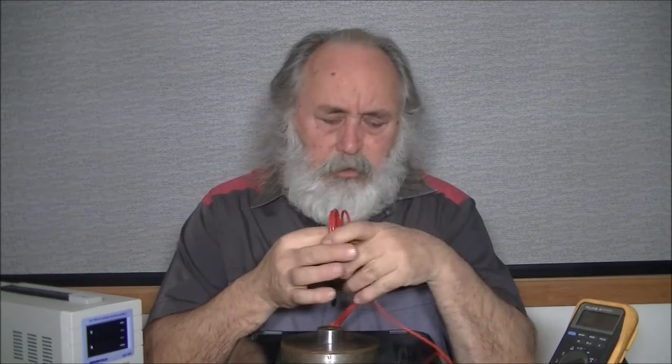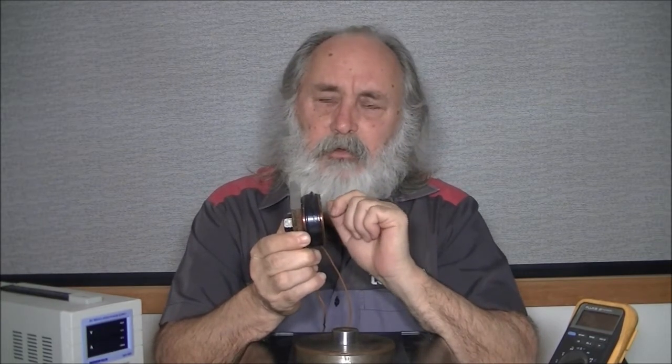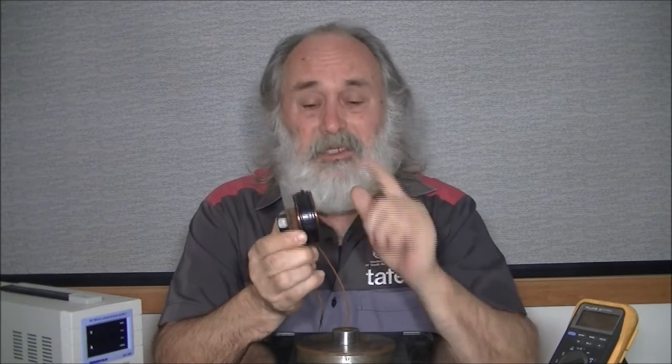The third thing we can do is add a soft metal core to the inside of our windings. Here we've got a very simple coil of wire with a soft iron core. When there's no current passing through it, very obviously there's no magnetic field. But as soon as we turn our power supply on and pass current through it, we can see it becomes a really strong magnetic field — no current, no field. When we have current flowing through a coil we have a north pole at one end and a south pole at the other, so the magnetic field around the coil looks very much like a magnetic field around a permanent magnet, but only when the current is switched on.